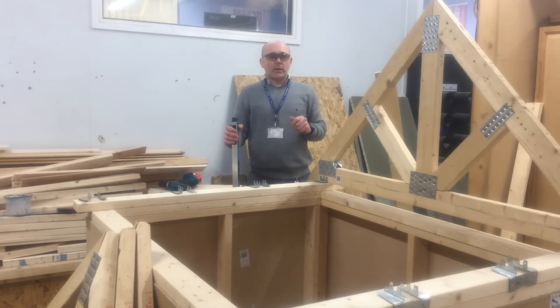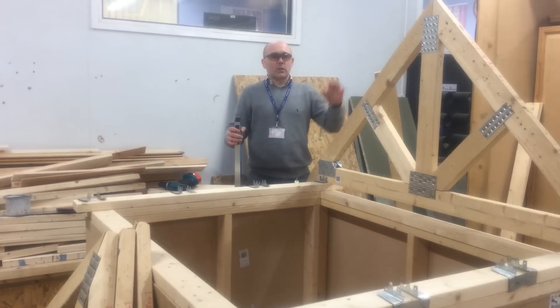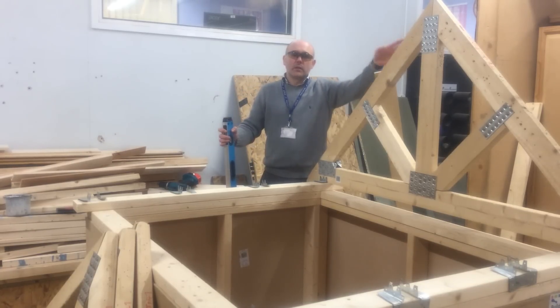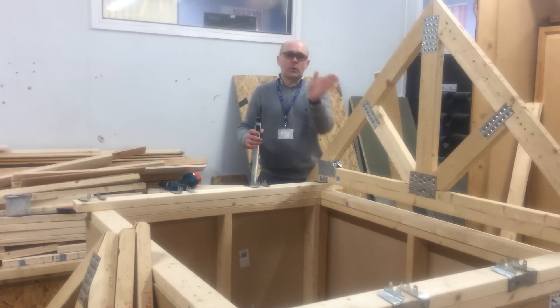You've got to be wary of that. If it is a big truss you will need to put two of these down and follow the same procedure each side, making sure it's nice and plumb before you carry on and get the other ones into position.